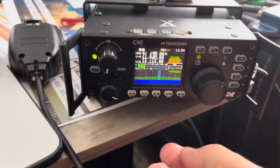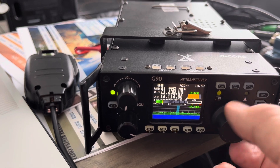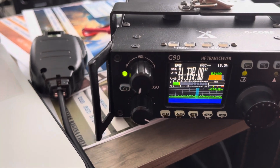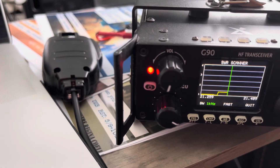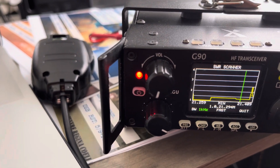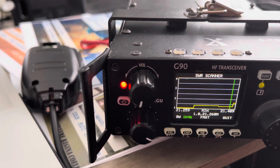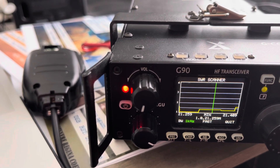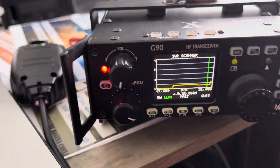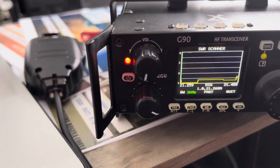Okay, 15 meters. Where do you want to be? Let's go down lower, kind of in the middle. There's a tuner — 15 meters, ladies and gentlemen. Boom. Look at that. Little bit of a spike in the 400s. A lot of your QSOs are going to be in that 21.2 to 21.4. And even still it's less than two at 21.4. Certainly 12 meters, 15 — yeah, man.